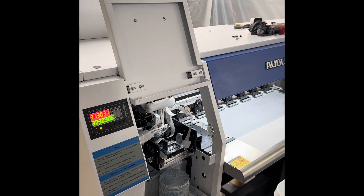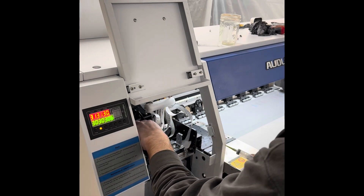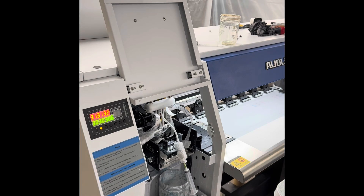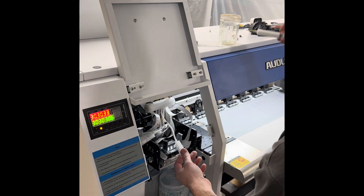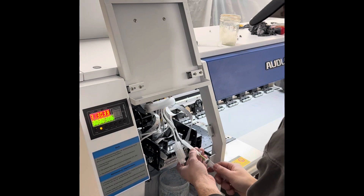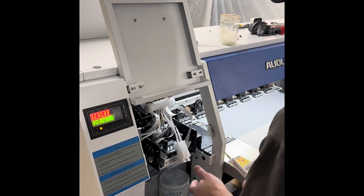Now I'm going to do white ink priming. I'm going to get rid of the rest of the water and put it in my humidifier just to get rid of it. Give this a little shake out. I'm going to prime my dampers again — pull 10 additional milliliters out of each damper, prime the white ink the way I've shown in my other videos manually, then reassemble and go back and do a nozzle check.